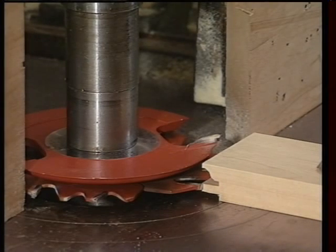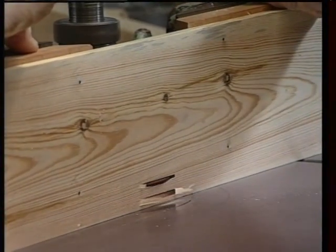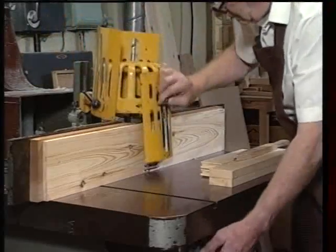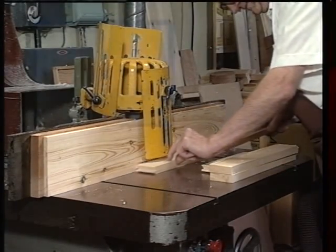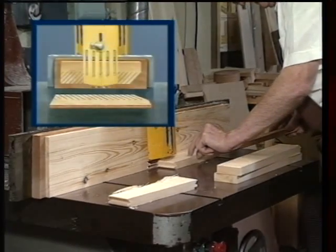The cutter is reversed and set to form the profile. All the pieces can then be moulded. In this sequence, the springs have been omitted to show the cut. This is a safe method. Top spring on, front spring on, guard in place, and go.